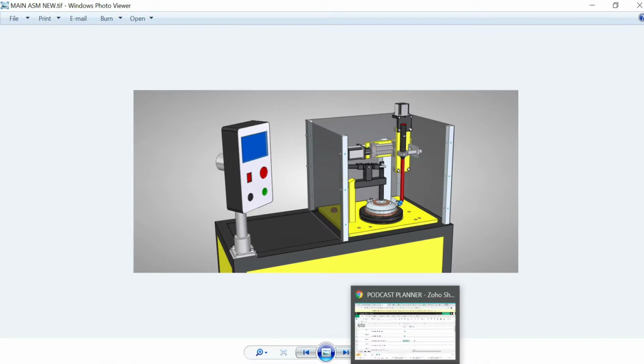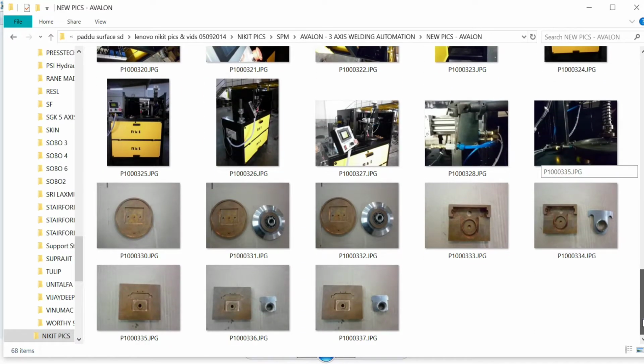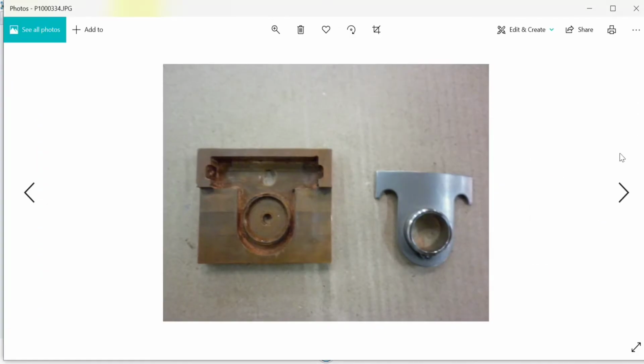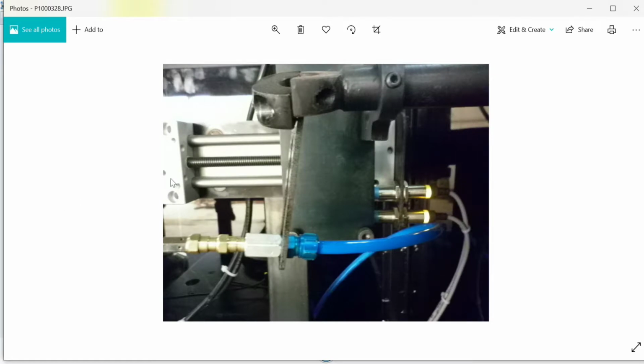Now coming back to our welding assembly. Basically, post determining the DAP and giving approvals for the process and the kind of costings, we go ahead, after preparing the drafts, to start over for our fixtures and other assemblies. Basically this fixture is designed for grommet and igniter assemblies. Based on the component we design the fixture, and as you can see, the fixture is made up of EC copper. All the fixtures that we do for such components are from EC copper. Basically it handles heat pretty well, and it's the best conductor. There are again different variations in copper as well, as you may all know, commercial grade and other grades. So we focused only on EC grade here.